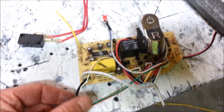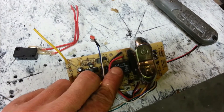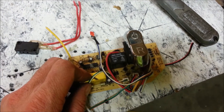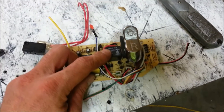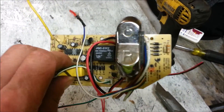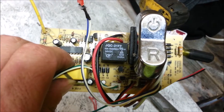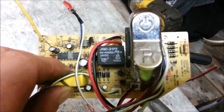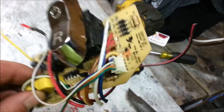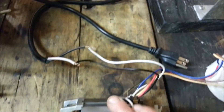I've pretty much come to the conclusion that this circuit merely sensed overload and used a relay to shut the device down. It also sensed the motor overheating and would use a relay to shut it down, and the rest of this circuitry is basically just an electronic transformer. The diodes are probably used to run the relay, because relays do not run on AC — it says DC right there. So there's an awful lot of diodes on there. Anyway, definitely a cool find — I don't know what this thing would cost brand new, but I'm loving it.